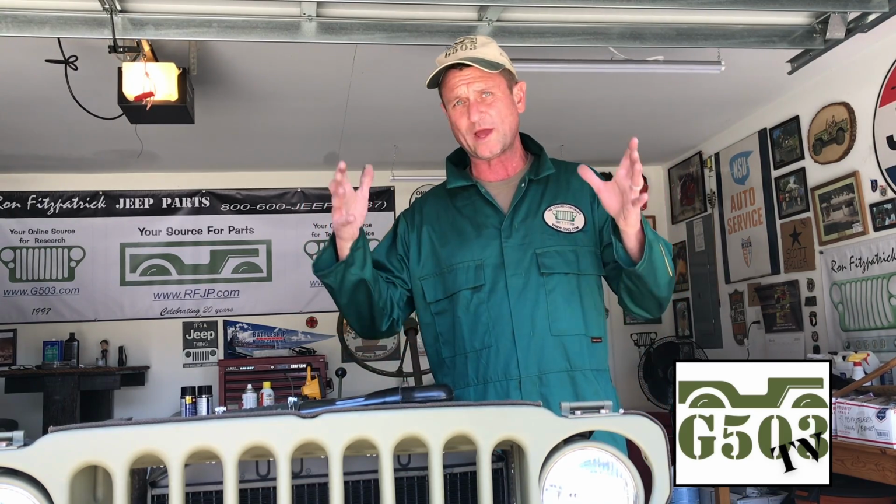In the previous video we posted, you saw Norm and the guys out there at Jimmy Strauss Jeeps starting to do a rebuild on an engine. And in the first video, they actually took the block, cleaned it, bored it out, and installed sleeves in it. In this video, we're going to show you the next step on how you deck the top of the block and clip the top of those sleeves back off so we've got a nice clean surface for our new head gasket to go between the head and the actual block itself.